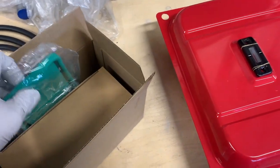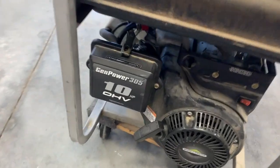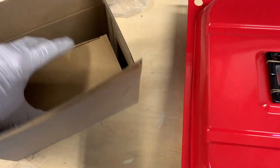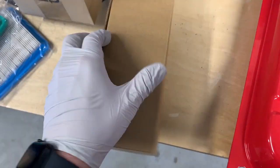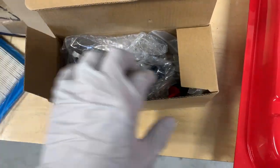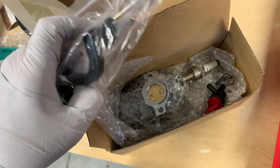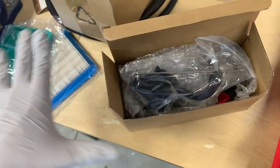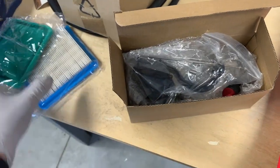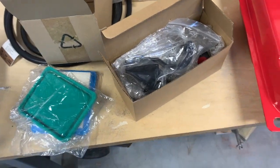While I was at Amazon, I went ahead and bought a tune-up kit. For this engine, which is actually a Honda OHV 10 horsepower, I came up with a really nice rebuild kit. It comes with new air filters, new throttle linkage, fuel filter, fuel shut-off valves, and the most important part — a brand-new carburetor — and even a new spark plug. All this stuff was only $19. Unless you're in a real bind and have to clean the carburetor out, just spend the money and get something aftermarket and throw it in there.